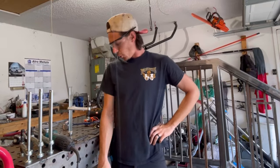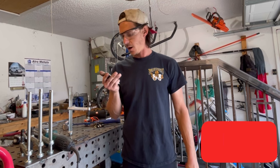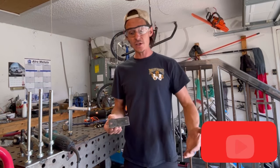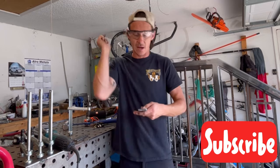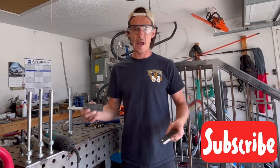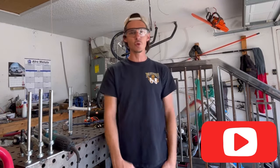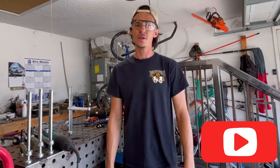Well guys, I hope you enjoyed this short little video. I hope it helps you do your layout and line up for your railing feet. Nobody showed me this — I had to figure it out over the course of a few years. I'm sure there's a more effective way to do this. Obviously, if you have an iron worker, that would be the best way — you could just stamp these out and stamp the holes right in between them. But you're still going to need to do a layout like I did in order to get the holes accurately in the center of your foot. Anyway guys, keep dragging on. I'm Melton Metal Anthony. I hope you enjoyed this short little video, and I'll catch you on the next one.